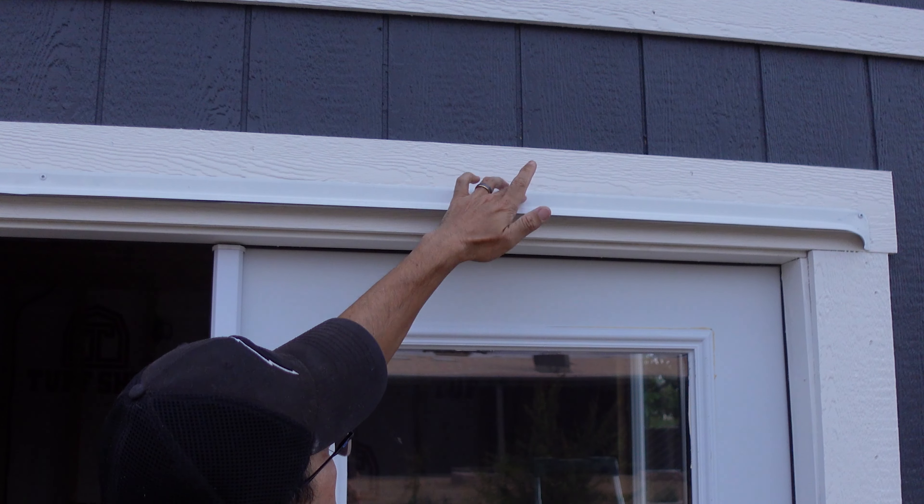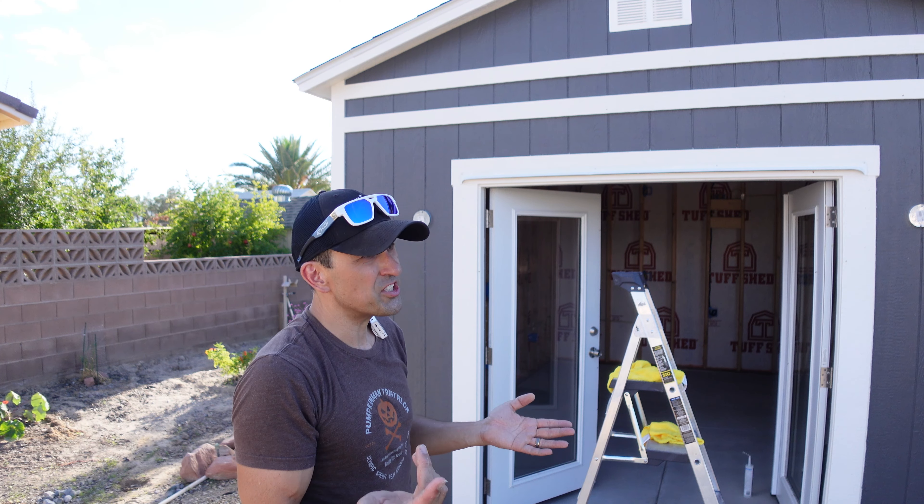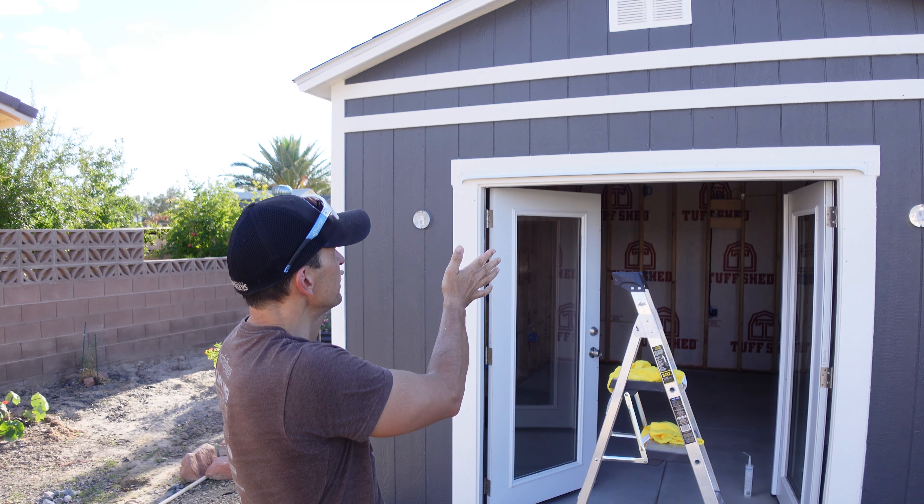Ironically, this piece up here is to redirect the rain, but that's not sealed either — so the water is just getting in behind this and coming straight down. Keep in mind that this is a shed, not a house. There's an awful lot of stuff you have to do that you wouldn't normally do when putting a room into a house, because this right here is all there is plus the framing. Making sure you have a good seal is really super important, because if you don't, you're going to get water inside your walls and then you're going to have rot. Even if you don't like doing DIY stuff, at least you might pick up enough information to know what to look for when you hire people for that type of work.